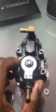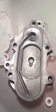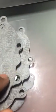Here's the diaphragm packet that you're going to purchase. Here's the top piece, and here's another — make sure that they go in with the notch aligned so they meet the notch. You have the plastic one, the pulse chamber, your other gasket, the bottom, and your back gasket.